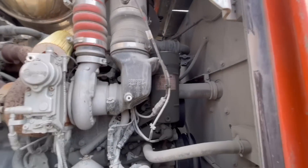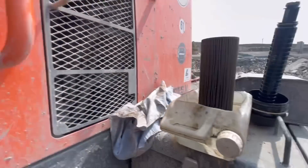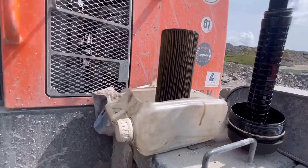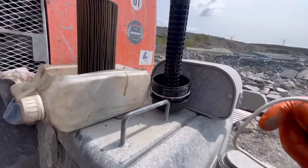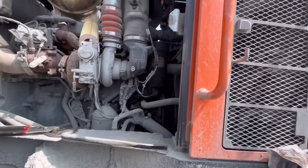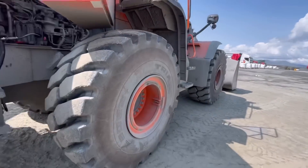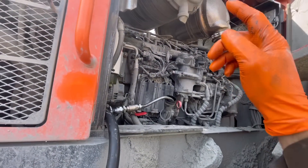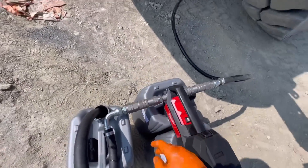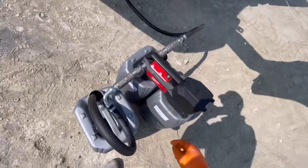You'll notice the engine oil filter housing's been a bit damp since the last service, so I've got a fresh O-ring to replace it. I'm sure I'll have done it last time but sometimes you get good ones and bad ones. I have had it before where I replaced the O-ring and it nipped itself — what a mess that makes when you start it up. All filters are changed — fuel filters done, engine oil filters done, pilot filters done. I'm filling the engine oil back up and greasing the driveshaft at the same time.